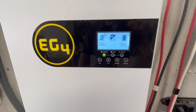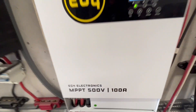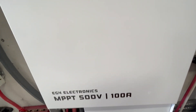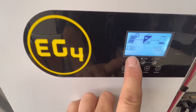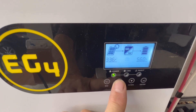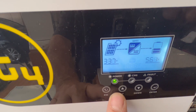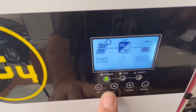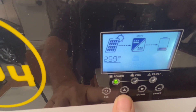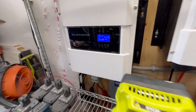I have to have this assisting it over there — it's a monster. But the nice thing is with this added, this is 500 volt DC in with a 100 amp output. You've got to keep the amps from the panels coming in below 22 amps; it wants to be around 18 amps but you can go up to a max of 22. Right now it's at 335 volts with those 22 panels — 11 in series and 11 in series — paralleled together with that branch connector. Yesterday I had this kicking up as high as almost 4 kilowatts while this was producing 5,500 watts.